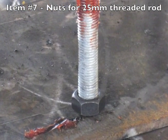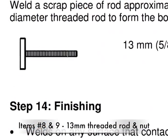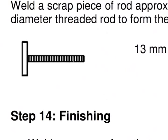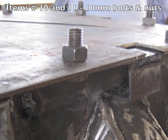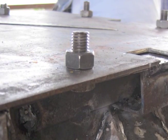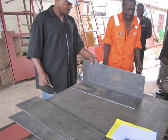You will need two nuts that can be fitted onto this steel rod. You will also need a thirteen millimeter or half inch threaded rod, one hundred and forty millimeters or five and a quarter inches long, plus one nut for this second piece. You will need twenty-eight bolts, ten millimeters or three-eighths of an inch in diameter, with a nut for each. Make sure you take the time to select sheet metal and angle iron that is straight and flat with as little rust as possible.